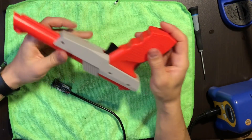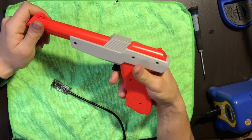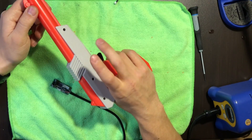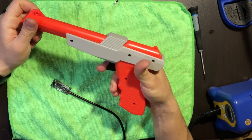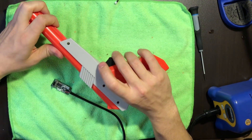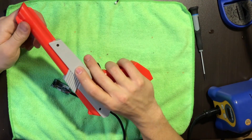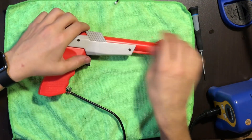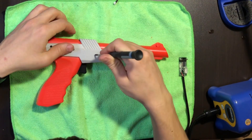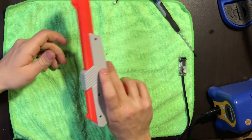You don't have to do this next step, but I'm going to install a button on the side so I can shoot bombs or do other functions in some of these games. You can add another one to the other side, but most games only require two triggers. I'll go ahead and get these buttons installed. For the trigger placement, I'm putting my finger out to see what feels comfortable when shooting the gun. There are actually seven positions, so I'm going to pick the fourth one, come down and center it in the gun. I'll mark it, drill the hole, and glue the button in place.